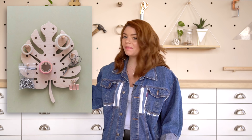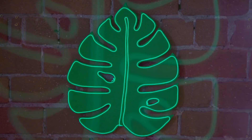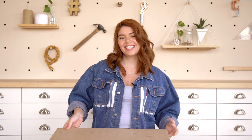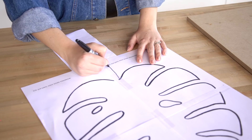This DM was sent to us by Reina, and it's this gorgeous Monstera leaf pegboard shelf. It's kind of similar to a large pegboard, but the best part is it's Monstera leaf shaped. If you remember our DIY neon Monstera leaf sign, it's great because you can use that template again. To make this shelf, I'm going to use MDF because we have a lot around the office, but you could use wood as well. The first step is tracing the template out onto the MDF. If you're using this template, ignore the holes in the middle and make sure you draw on a little stem first.